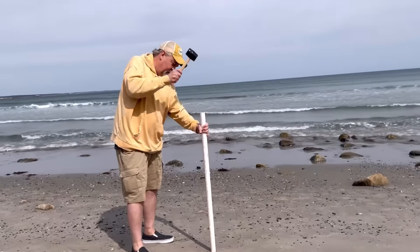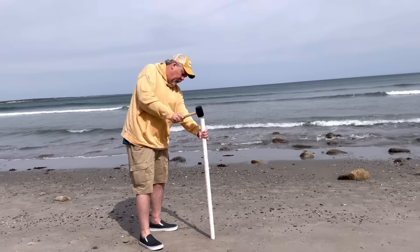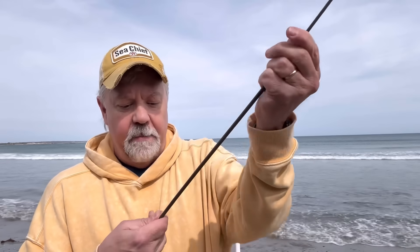The next thing we're going to do is my pole. This is a DX Commander Expedition Pole, a little under 10 meters long. The antenna itself is 7.6 meters, so I'm going to extend it. I've already driven a piece of PVC pipe in the ground with a rubber mallet — that's why I'll slide the pole on top of it. But for now I'm going to extend the pole and get it up so we can tape that driven element to it a little bit at a time. These poles are so easy to extend — go up, twist, up, twist, up, twist, and so on. Let me get this pole extended.